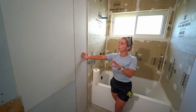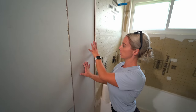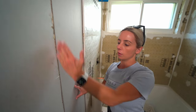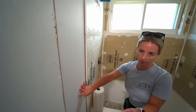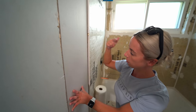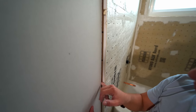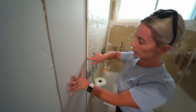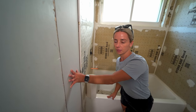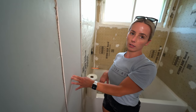What we're going to do is double up the drywall. I'm cutting this piece in as a filler from stud to stud. It's not exact because there are so many variations in the way this drywall was cut, so we're going to screw this in and then go on top with another layer of drywall. That will hit flush with our half-inch foam board that we brought out here — the foam board is what we brought in to fit this tub. We're going to get this hung and move on to the next step.